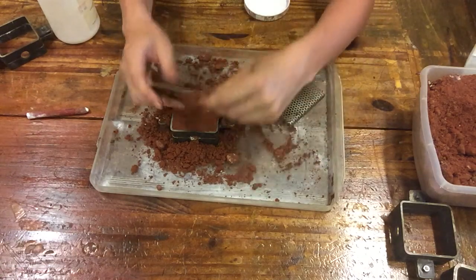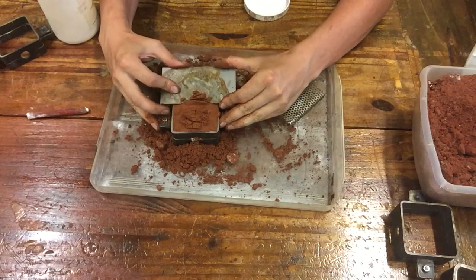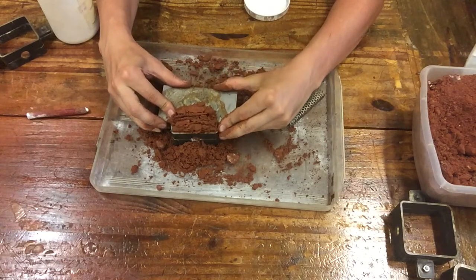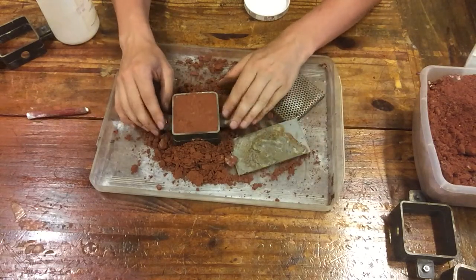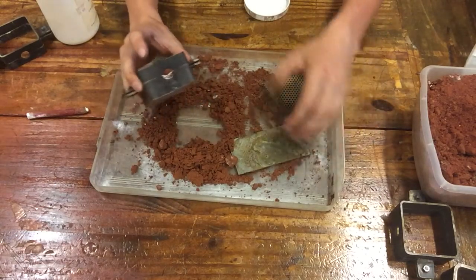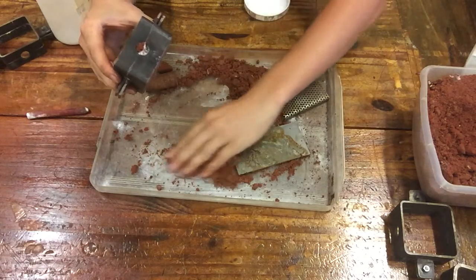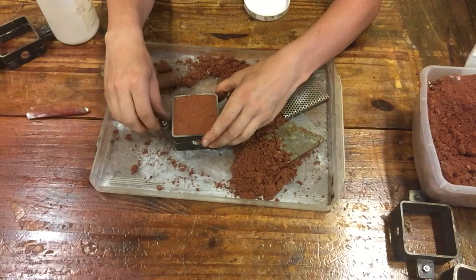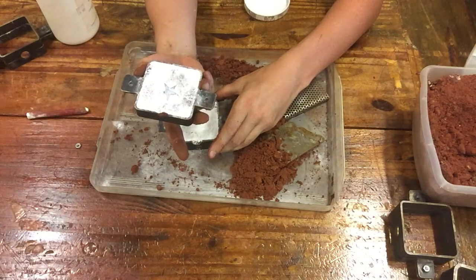Okay. So then at this point, ready to just scrape a little off the top. And the sheet metal acts as a little shear, peeling it all away nicely. There we go. So, we can then take our part, move all of our sand aside, remove the nut, and then lift our part out, and you'll see the master part is registered in there.